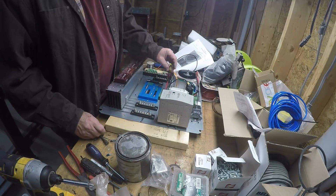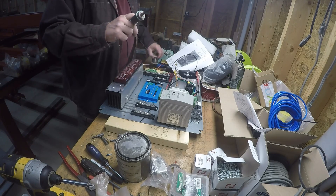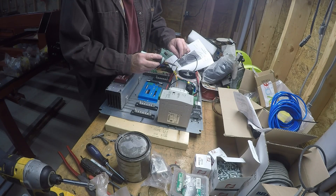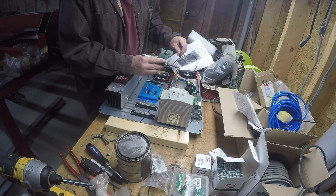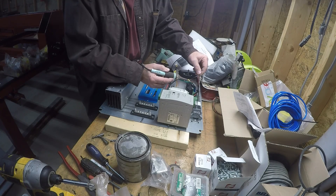I wired up the supply and put the ends on there. I'm going to solder the ends because I think it'll be a good idea. Anybody who does soldering, keep the tip clean — just put it in there until it gets hot. If you solder the end you won't have issues. After I crimped it, it's starting to melt in there — flow is nice. Be sure you use solder designed for wiring, minimal flux core.